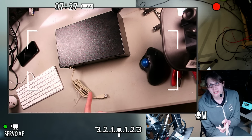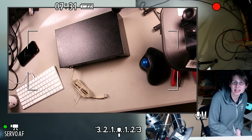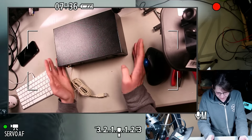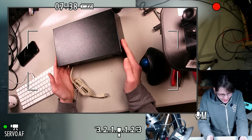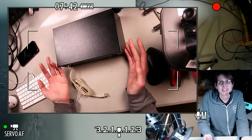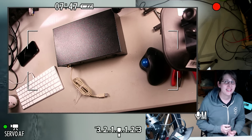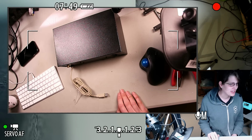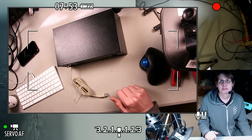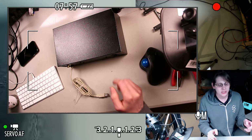And if I remember right, this device has very little hardware buffer. I think it can only handle 8-byte packets or something absurd like that, but it's probably a little bigger than that. So that's another reason why this couldn't just act like a regular USB serial device. It had to shoehorn both this FIFO of infrared data and this auxiliary serial port into this weird protocol that was really restricted both by the hardware on this chip and by the actual USB spec it was trying to follow.